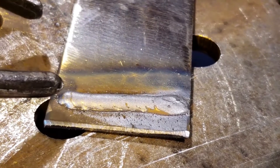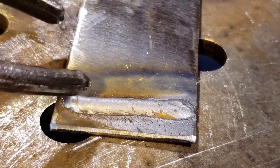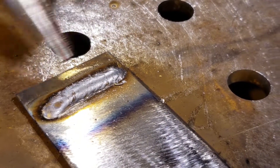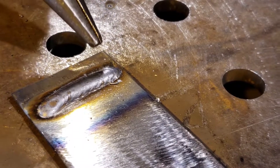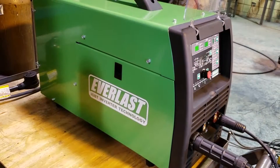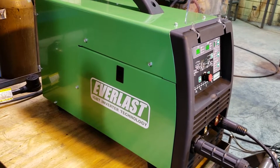When the machine started out, it flared just a little bit. We had the bead start up and then everything laid down nice. The edges are wetted in nicely, it's got a nice crown to it. I went ahead and made another weld across here and it laid down even better because it kind of had a place to go. So edges are nicely fused, it's got a nice bead profile. That's how you set the Synergic mode of gas metal arc welding on the 221.